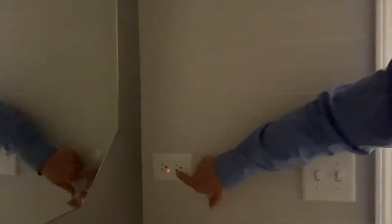This one's got the red light, so I'm going to give it a good push on the test, and then hit the reset button, and everything turns back on. Always start there if you're having an issue with outlets — any outlet that has a GFI, which is going to be in any wet location. I hope you found this video helpful. If you like it, please give it a thumbs up and subscribe.